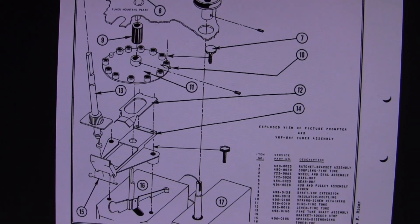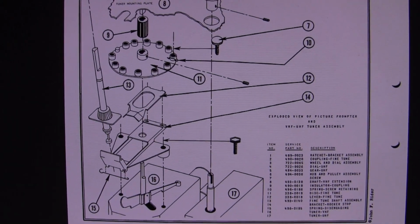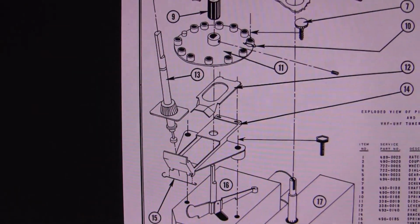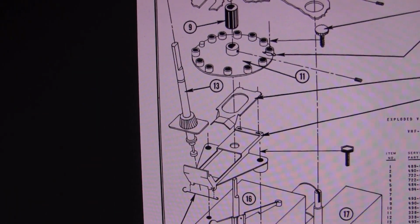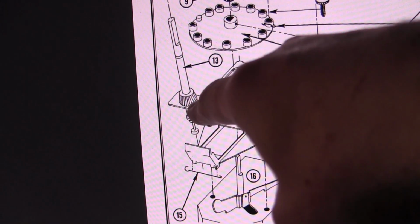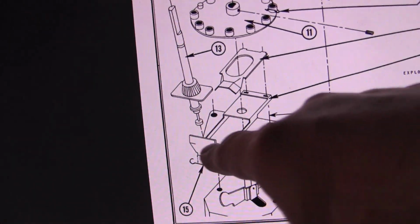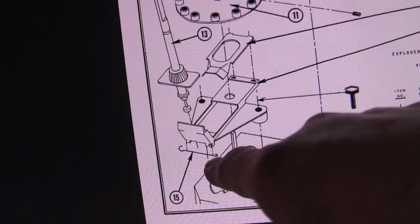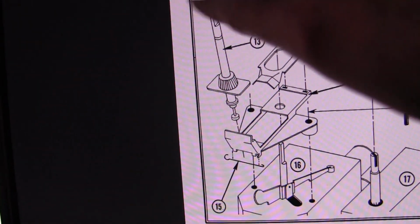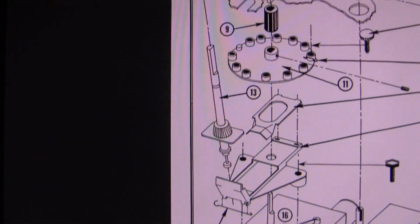I did find the tuner in the Sylvania service info reprinted in Riders. And there is that fine tuning shaft I was trying to explain the operation of. And see, there's that rectangular piece of metal, and this sits down in here, and that piece of metal smacks into that, and there's that little tensioning spring that rides against that, so you need to push this forward to engage with the gears up there.